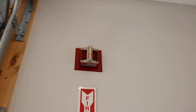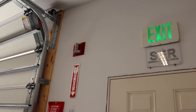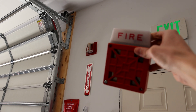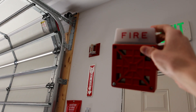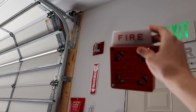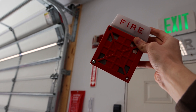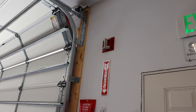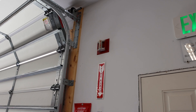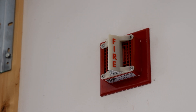It's not like the Wheelock 7002T that has a parasitic strobe, as seen right here, where both the strobe and the horn are kind of required — the strobe is wired straight into the horn mechanism, and that is why you hear the strobe skipping on that alarm. Whereas with the ADT alarm today, you will not hear strobe skipping because the strobe is wired independently.